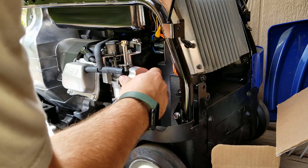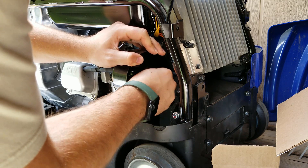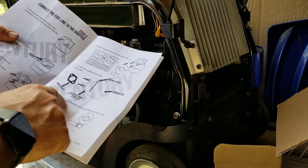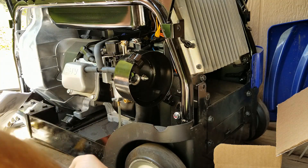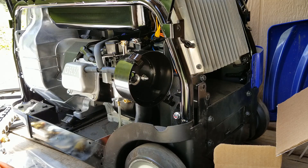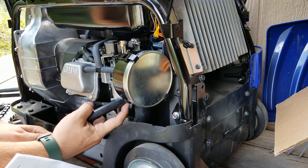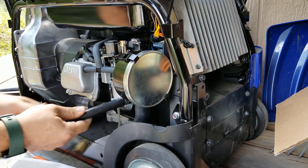Okay, so we've got that on. Put this housing on and put these nuts right back in here. Reassemble the air cleaner assembly. Connect the fuel line to the adapter and clamp it down using the hose clamp provided in the kit. Here we've got a hose clamp, and I'm assuming they mean this shorter black hose — this is just a barb fitting. Put the hose clamp on, put the hose over the barb fitting, and now it's nice and secure on there.